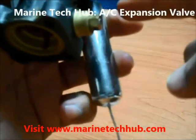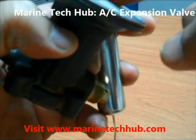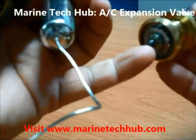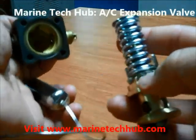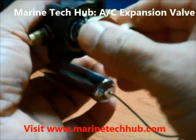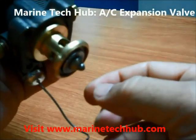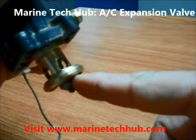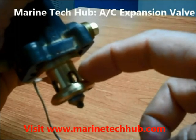When expansion takes place, this will press the diaphragm. The diaphragm will press this portion of the rod in order to open the valve. This spindle will go in straight like this inside, and then this spindle will move down. The liquid coming from here will come out through this and the expansion will take place.